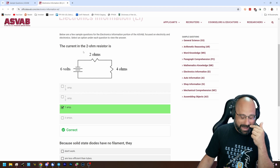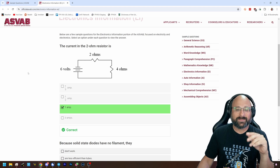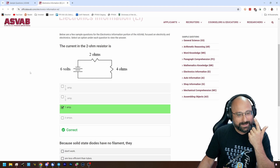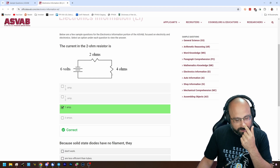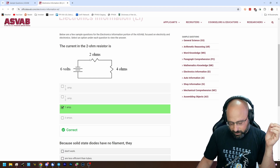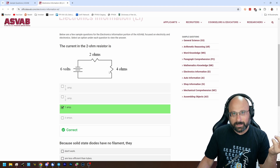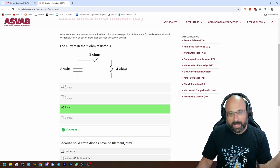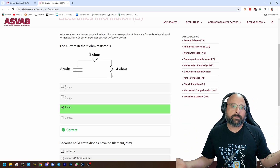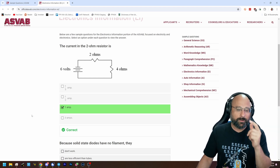If they had asked about power dissipation in a resistor I'd have to look up the formula. But for this one my whole thought process was: I have two resistors. Kirchhoff's law says the current through a circuit is the same at every point, so the fact that there are two resistors can't matter. It'll be the same current everywhere, so you must just add up the resistance and treat it as one resistor. Six divided by six — it's a trick question. It's one amp. And then I went: how do I know that?